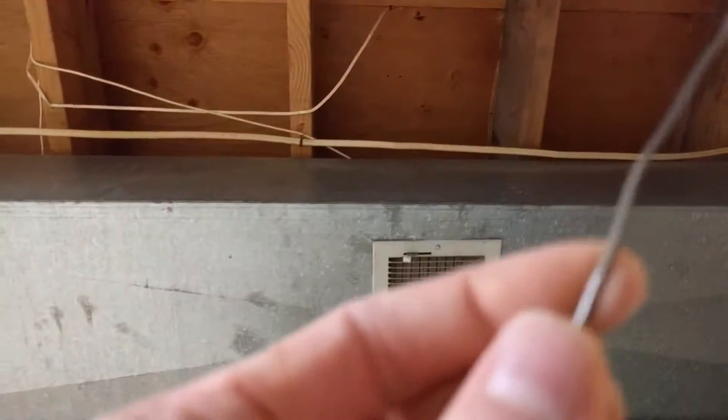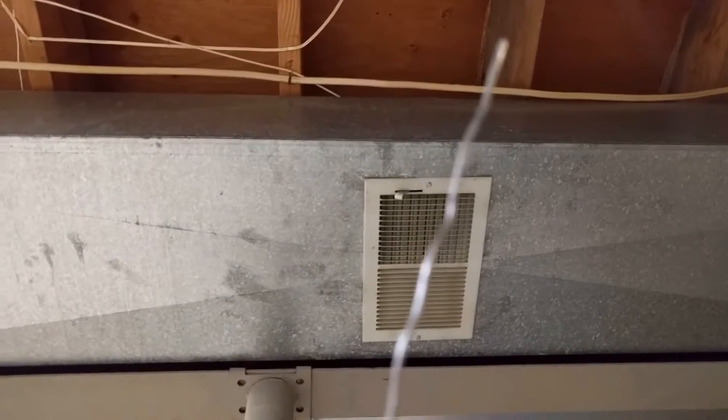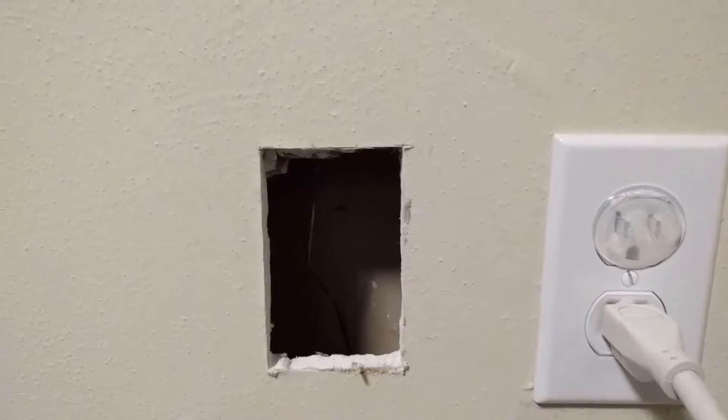There are a few pre-existing holes and I've drilled an extra one right here, which is what I'm going to use to pull my cable through. I've got some wire that I'm going to run through first — I'll have to bore it out bigger so I can actually pull cable through. I'm going to drill that one out a little bigger and then use my snake wire to attach the cable to the end of it and pull it through. The box right there is what I measured from to make sure my hole is in the right place.